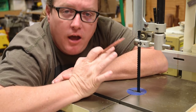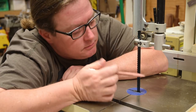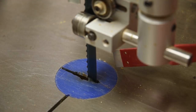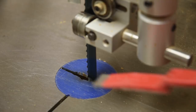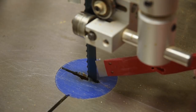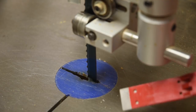That's only a portion of it. The other parts include how the teeth are set and what you do to the back side of the blade. When you install a brand new blade, it is generally advised that you round over the back of the blade. Not only will this prevent it from damaging the bearings as much, but it will give you a little bit more flexibility, because the back of the blade is just as important as the teeth.